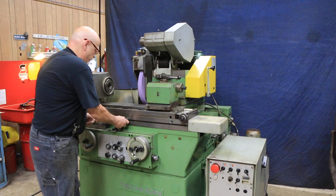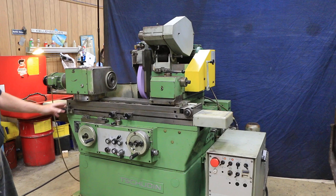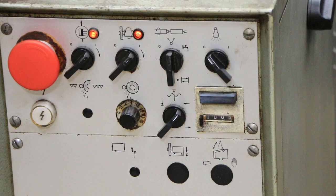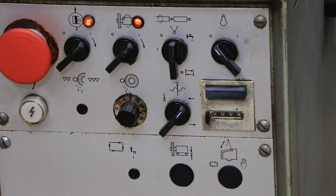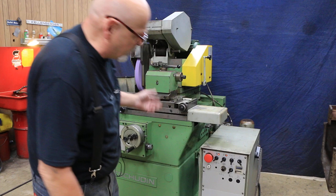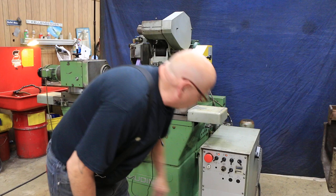When it gets to zero, this machine has a counter. In this little window here you can see it counting down from eight to seven, six, five, four, three, two — and it'll stop on this side because I have that arrow selected. As soon as it kicks out it resets itself, and up here you can set how many strokes. That's what's known as a stroke counter — nice to have.